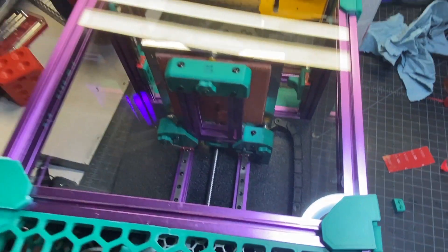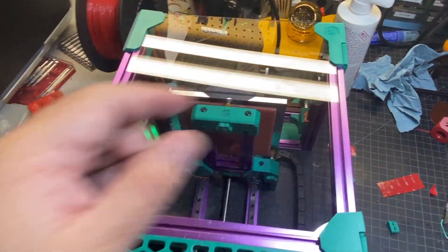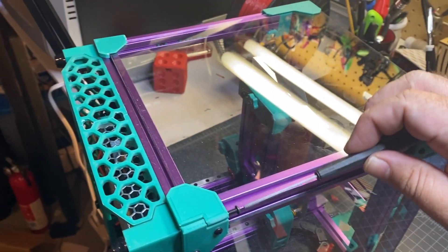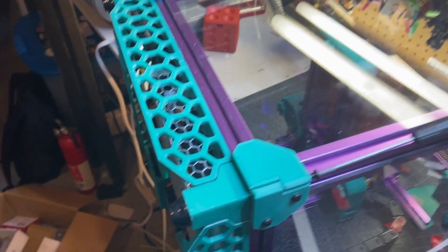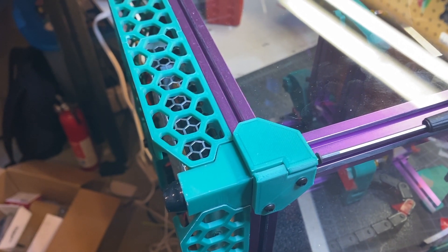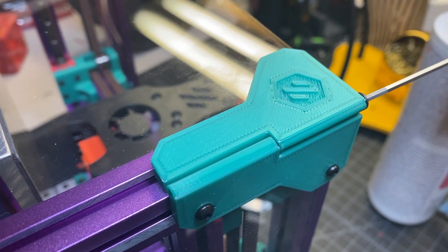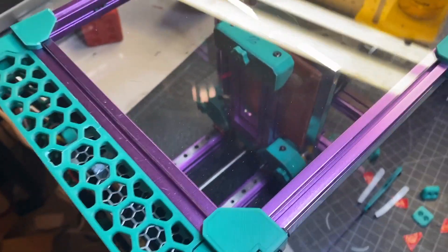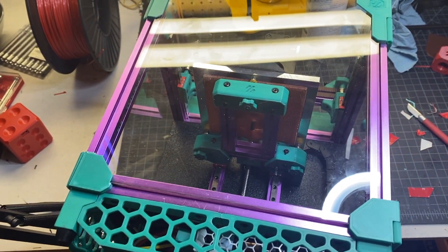When doing the front panel, your pieces should be laid out like this. There are no holes but there are hinges, so make sure this piece is oriented correctly. You're going to need an M3 screw — same with the bottom right piece, which also gets a screw to complete the hinge. Pay attention when putting this on to make sure you have everything on the right side. To finish up the front panel, put in an M3x25 screw here — it's more like self-tapping because it fits a little tight, which is good. Then on the top you need an M3x40, and now it should open and close.